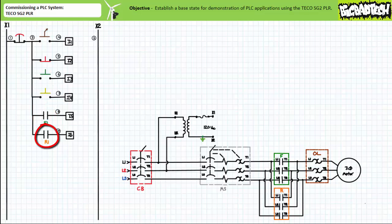The first four field input devices are intended for human initiated interaction with our system, whereas the auxiliary contacts on inputs five and six serve as feedback about the status of a particular contactor. Note the maintain contact normally closed e-stop is not a direct input to the PLC,